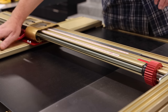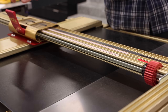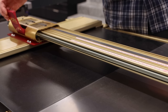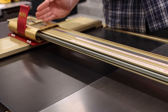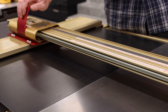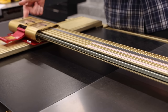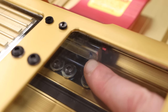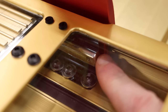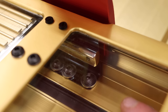It cannot lock in between that. This right here is how you clamp and unclamp and also use the micro adjust. If this was all the way open and I slid it forward and went to lock it down, it just moved a little bit. If it was not exactly on a 32nd of an inch increment, it will automatically adjust in order to do that. Right in here you can see that this also has those grooves — when you lock this, it pushes into that rod, and when those two meet up, that's how they lock in perfect 32nd of an inch increments.